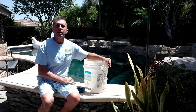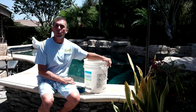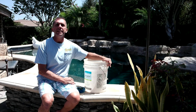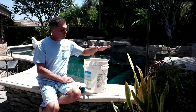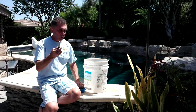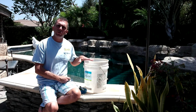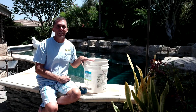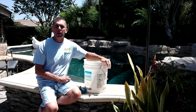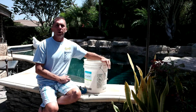One of the top items on the list is to make sure that your existing swimming pool is not leaking. The easy way that every homeowner can do that themselves is through a bucket test. You're going to need a bucket, a marker, and some tape. One important thing is to make sure if you have an autofill, turn that off so it's not adding water during your test. I would also leave the pump and all circulation off for the 24-hour period while you do your test.